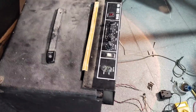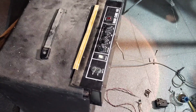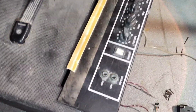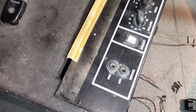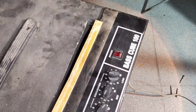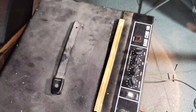So that is the idea, that we fix in a Bluetooth module which runs on 5 volts into the input stage of this ampli speaker, and we take the power off the mains and make it a Bluetooth speaker with karaoke kind of functions.